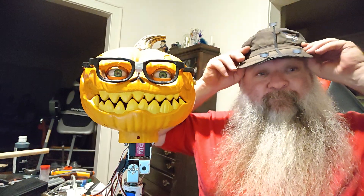Some of the motions that are really human: when you're looking at something, as you move your head up and down, your eyes tend to stay looking forward. So when I do hand programming, I'll move the eyes up as I'm moving the head down to give the forward sinister look, or to look down his nose at everybody. Also, when people turn their head, they tend to lead with their eyes and then turn their head to center them — so look where you're going to turn, and then as you turn your head, you center your eyes. I'm going to need to practice the joystick for the eyes. What's really nice about the software is you can record a skit and then export it in many different formats — the one I was concerned with is LightOrama.